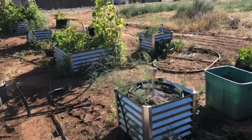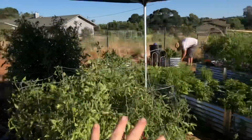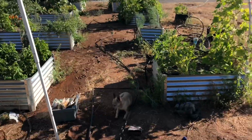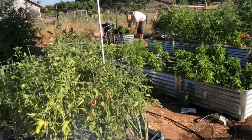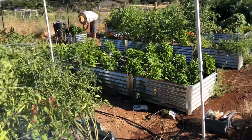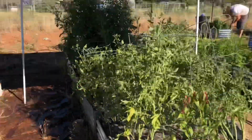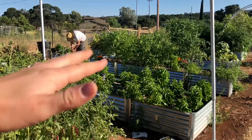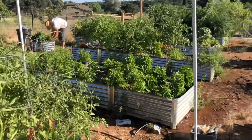And we have them set up in zones. So we're going to have zone 1, zone 2, zone 3, and then zone 4. And they're all going to go off at different times. That way the pressure is more stable. Otherwise it's going to favor some areas because of how it goes up at a slant. So by doing different zones, this will help give adequate pressure and watering to all the different zones.